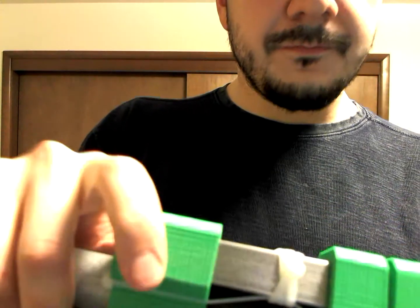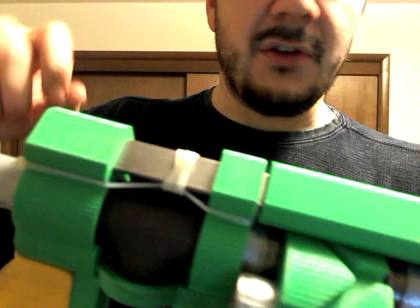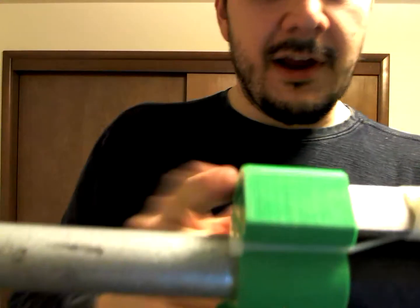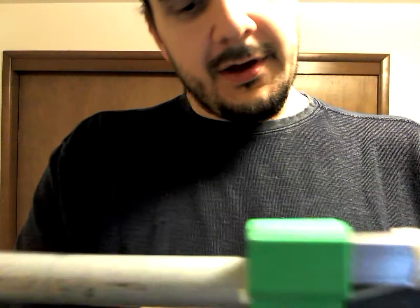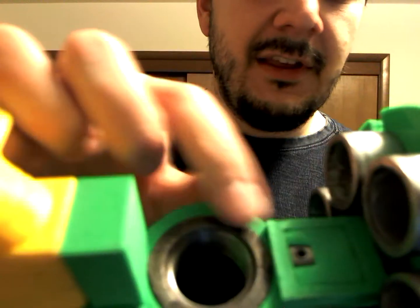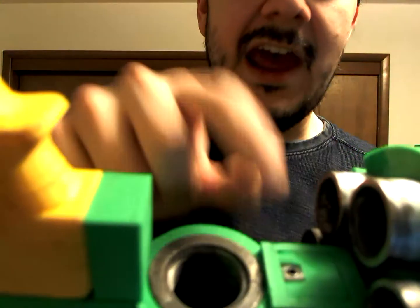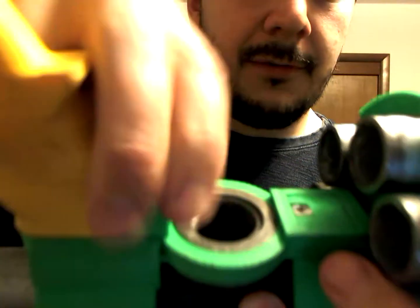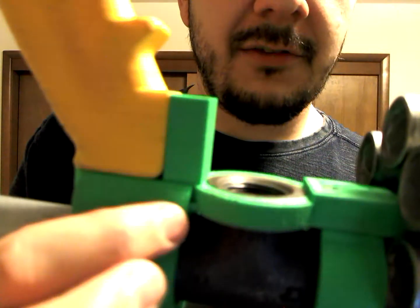Let me show you the T. Before it was just a clamp piece, and I've redone that. I'm trying to keep all the strength in the ideal axis for where I'm taking forces, so I skeletonized the T housing. I now have this piece where the front end is the bottom and it prints upward that way; on this side it's the other way around. This bottom box fits around a smaller inside piece — a little tab basically. I put the shaft collar there, and once you tighten it, it holds the bottom piece on. This back piece is slotted and pushes forward to slot onto the bottom piece.